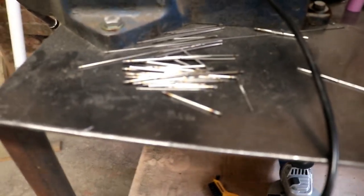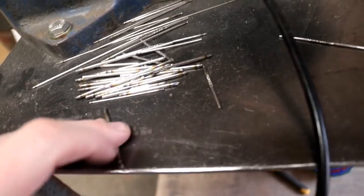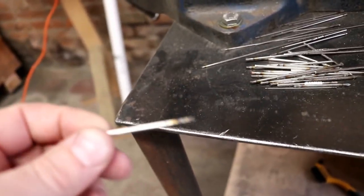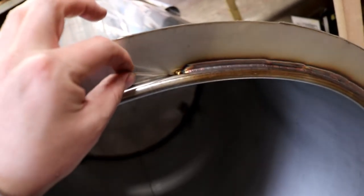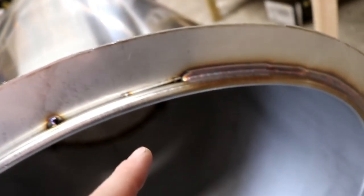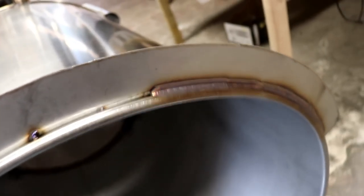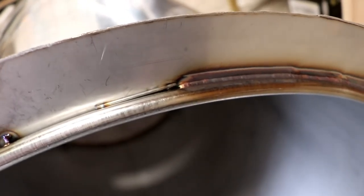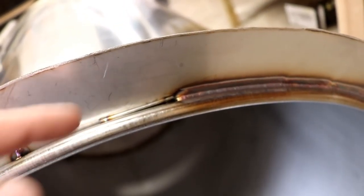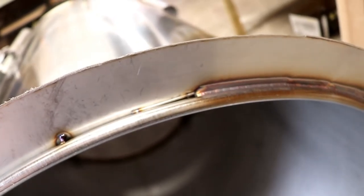All of the ends of the welding rods, the electrodes that I've got, I saved them all. They're too small to use because you burn your fingers. But on this occasion, there's a gap just there, and they rest in nicely. So because I'm getting short on the 2.4mm rods, and that's what I really want to be using for this, I can just drop all of the stubby bits in and whiz around like that.